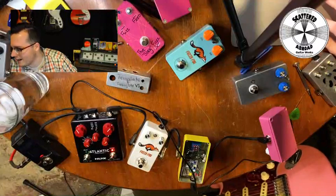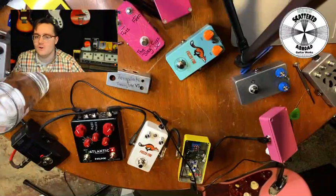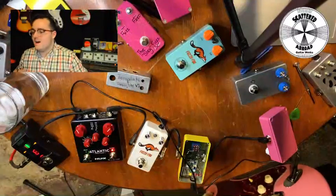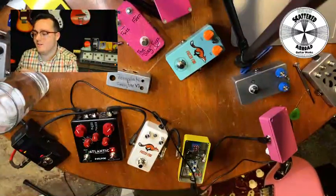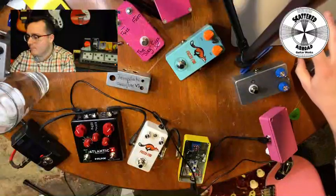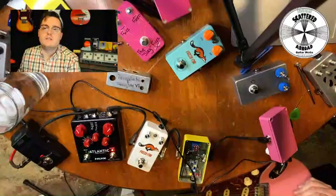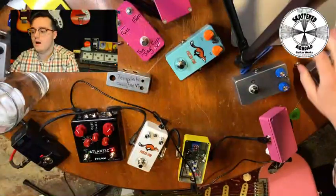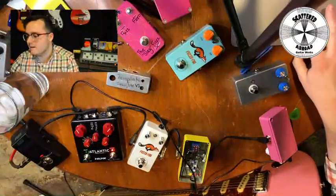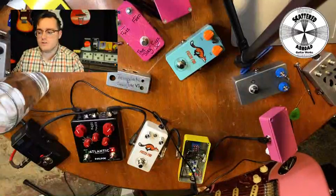Let's see. Tony, what's the Hangry Mod version then? You're probably referring to the Stompbox Fuzz, I'm assuming. Yeah, because I put a little bit of a mod on that, made it a little bit higher headroom, a little bit more gnarly, if you will. That is a bit of a different clipping circuit, and it's pushing the transistors a lot more overall in that circuit. So it's producing more of a fuzz rather than an overdrive.